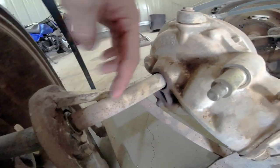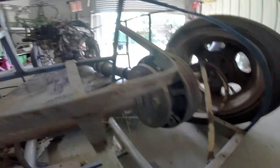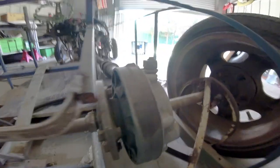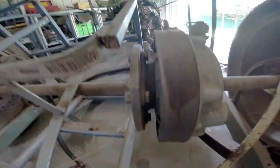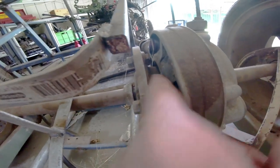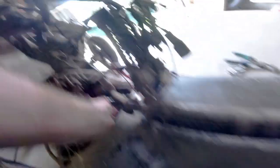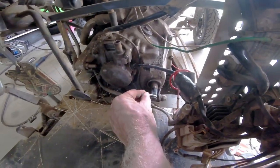You can see where there's a 25mm axle - I've bored out the center of this so that axle will fit right through. So that's one solid axle. This is a 25mm hub and just some steel plate I had that I drilled to fit into here - so that's bolted to there, which is keyed into the axle, and that just slides inside. It's got like a spline center in there. I'll undo this one and show you how it joins on. You can see this is the bolt that I've just pulled out of there - it just locates back into that. When that bolt goes in it holds it from going back and forward.